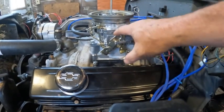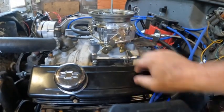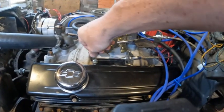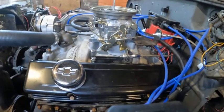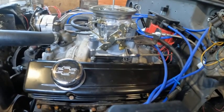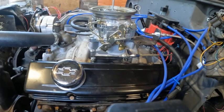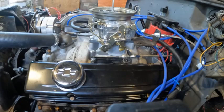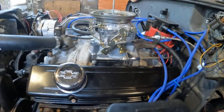As you can see I've got a brick on the throttle holding it down. Now I've got to set this — you can pull it a certain amount and you want tension on it, but you don't want so much tension that you're damaging the linkage inside. It takes a little practice, and there are two parts to the setting: full throttle and part throttle.